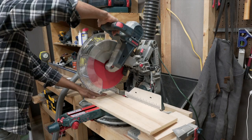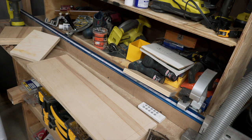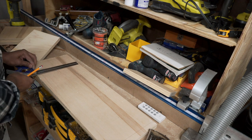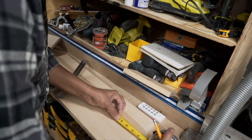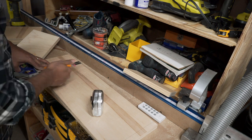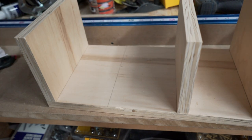I also cut some scrap pieces for the drill holding station. Then I mark the slot for individual dividers. There'll be 5 dividers, so it can hold up to 5 tools. I use the technique that people use for framing out the walls with 2x4. I mark a line where the board should align and then mark an X next to it to see which side of the line should the board align. Here's a close-up of that. I need to add these additional markings and lines and things like that because otherwise I totally mess it up.